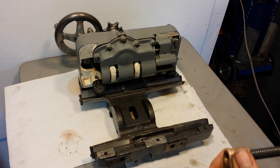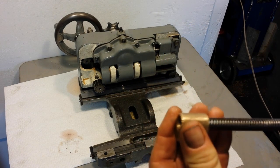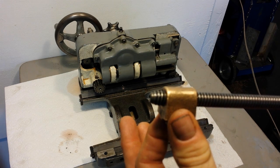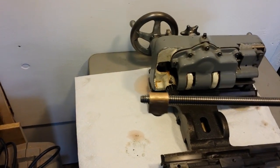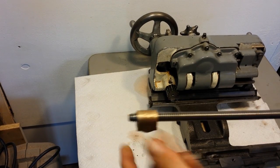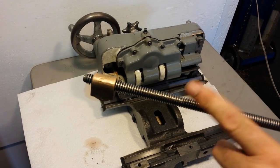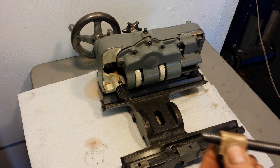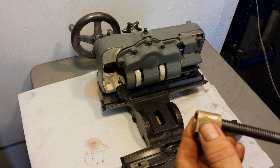The nut that's now in there matches up very nicely. I did have these two together, so this one may have cut a little bit on this nut, but just to show what kind of improvement we can get — I'm hoping you can see that wiggle. We can wiggle the old nut a little bit. With the new nut, because it's been essentially chased in to match the condition of this screw, none of that is present. It's a much tighter fit. It does take a little more effort to crank, but not a whole lot more.